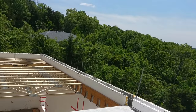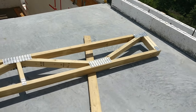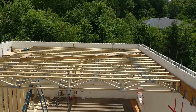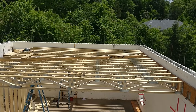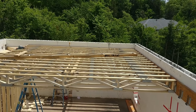I'm going to turn around here so you can walk us through what you're looking at. We just got the light deck poured last week, and I think you've posted on that. So today we are starting on the web joists for the wood floor that we'll have over this area. We have 16-inch LVLs that we embed into the ICF before we pour.